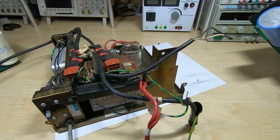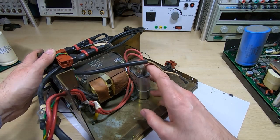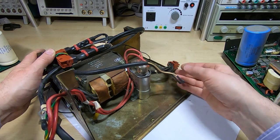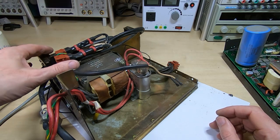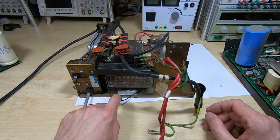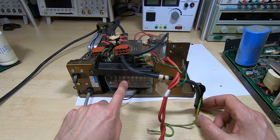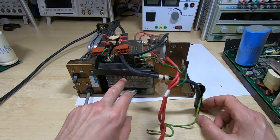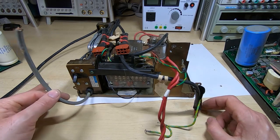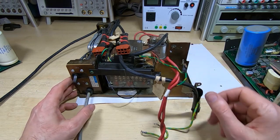I have the main part of the supply disconnected. The main chassis doesn't look too bad — it needs cleaning up. I'll take a few of these parts off so I can give it a proper clean and check all the connections. In the next video we'll start running some power into this, using the Variac to bring it up slowly. I think this arrangement here is the voltage selector, and I do have a service manual — it doesn't include schematics but does include some information about the mains voltage wiring. I'll fit a new mains lead of course. We'll have a quick look at the supply board and try to get it out of the housing.